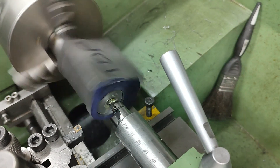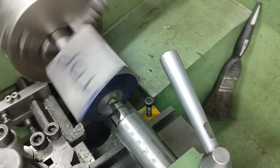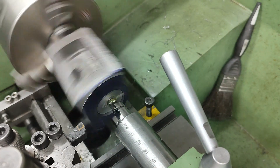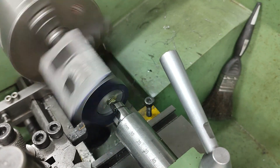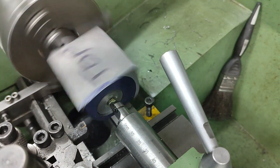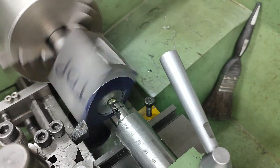When I reverse the cylinder block to face off the other end, I realised I didn't have the dead centre in place to provide that little bit of extra support to the mandrel. So for this face I rearranged the setup slightly so that I could get the dead centre back in position, and after facing off this end I did swap back around again and put a final cut on the other face to ensure it was square.